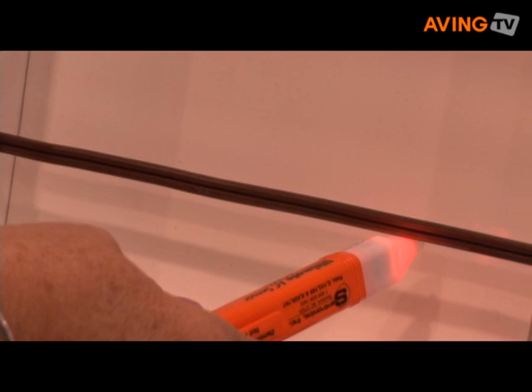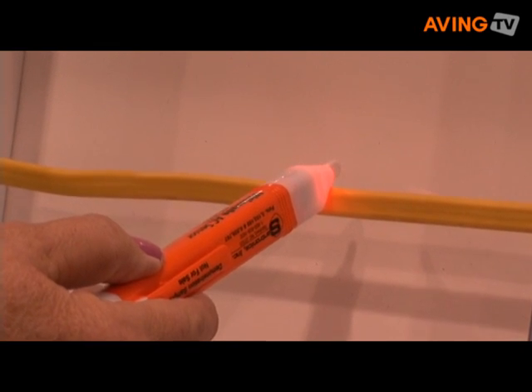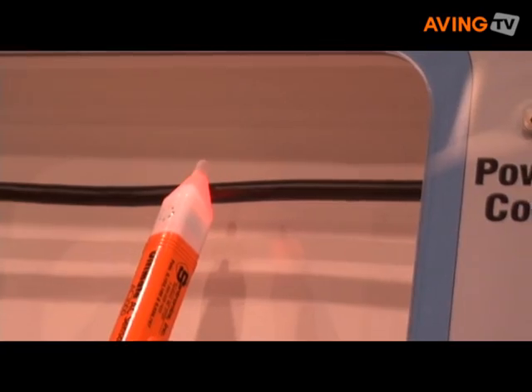You can see it's red. If this had a break in it, the light actually would go out and show you exactly where the break is located. It works through the exterior of Romex and the round cord. So you can use it in various applications for troubleshooting and to see if something is working properly or not.